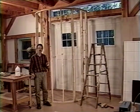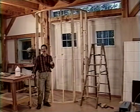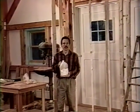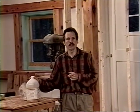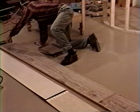My stringer consists of 1/8" plywood with a 1/16" skin of mahogany on both sides. For this layup, I'm going to use the rigid type glue. I need a long open work time with so many laminations, and I want a rigid glue to minimize the spring back. Urea resin is the glue I'm going to use on this, as I did for the arch jamb also. I'll spread the glue on all the layers.